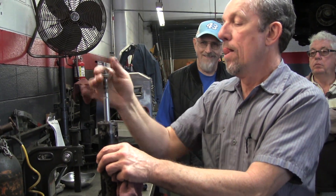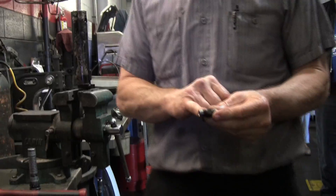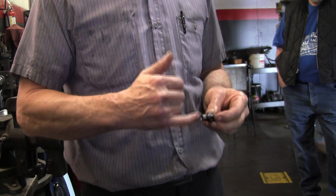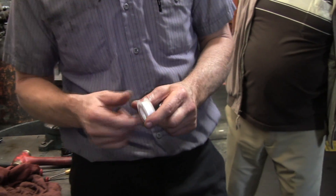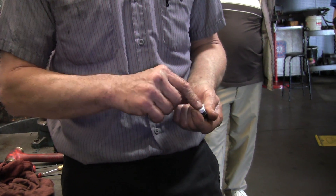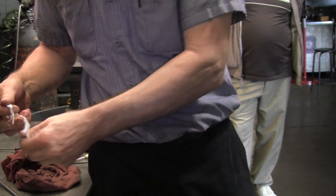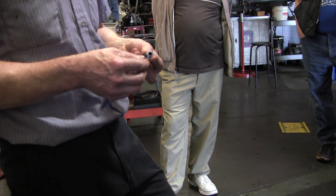So what's the torque spec on the screws? What size is that screw? Look it up. This fitting here is a pipe — it's got quarter-inch pipe on this side and tubing on this side, so this has to have some sort of sealer on it. You can use RTV or you can use pipe tape. A lot of people hate this stuff because they don't use it right — they'll put it on there, wrap it around, and then screw it in, and then this crap gets in the system. Don't do that.